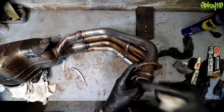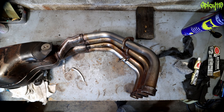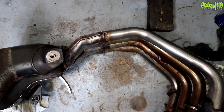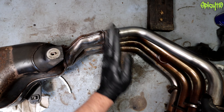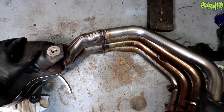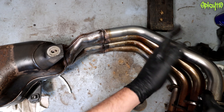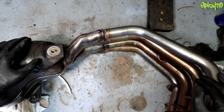It is possible to get new flanges — you can grind out the weld and pop them on and have them welded back in, or weld them yourself if you can. For this exhaust, the video idea was a bit of a disaster because it was so bad, but if you want to save one like this, wire wheel it off — I'd sandblast it myself to get into all the nooks and crannies and not leave any rust behind. Don't sandblast the pipes themselves though — do those as I've shown you. If it's really bad, use sandpaper starting around 400 grit, then work through grades up to 1000 grit or so with some oil to smooth and polish them up. The more effort, the better the result.